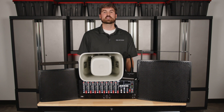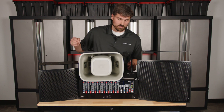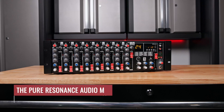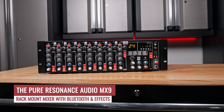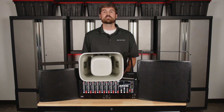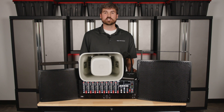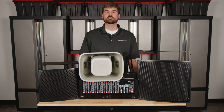The DA2500 has 500 watts per channel, so you get good output from this unit and have a lot to work with. If you need something that can really drive speakers, this could be a good option. Sitting just above it with all these buttons and knobs is our MX9, which is a mixer where all of your sources would go into — your music source, your microphones, anything you want to play through the system. This mixer allows you to adjust volume, EQ adjustments, so that it can go through your power amplifier and be projected over your loudspeakers.